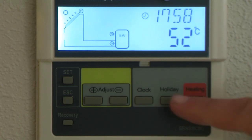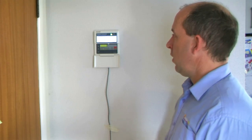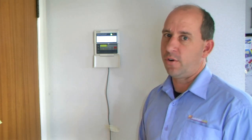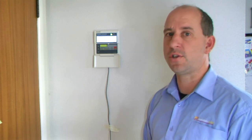The next button is the holiday button. Hold your finger down on this button for 3 seconds and a little palm tree will come up — so hopefully you're going somewhere nice. This does a couple of things. One, it keeps your element off because you don't want your element running while you're away. The second thing is at night time it will cool your system down — when it's 20 degrees lower on the roof than in the bottom of your cylinder, it'll pump cold water around just to cool the system down, as if you were using some hot water yourself.